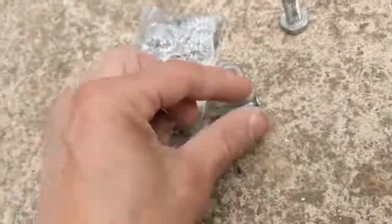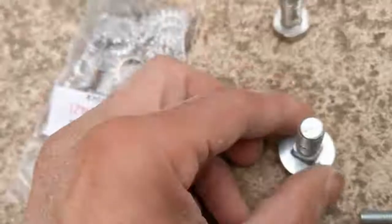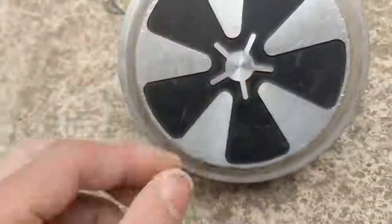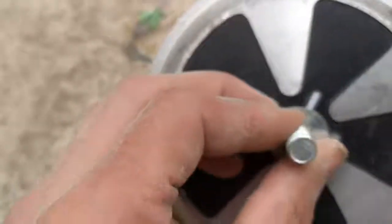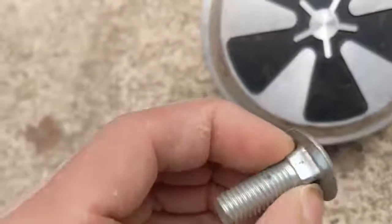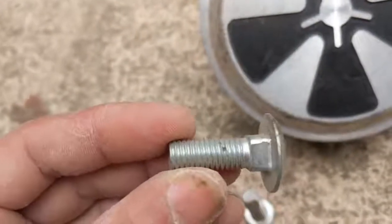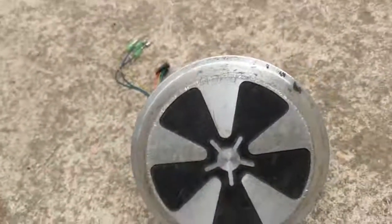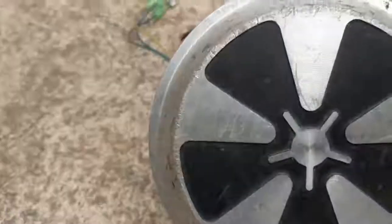When I looked for such a screw in 10 mm I found this one. You might have to make it a bit smaller — maybe 50 mm space inside, flattening by another two millimeters before the bearing begins. You would have to turn the screw into the square and be careful that it stays centered, since the square is a little bit bigger than 10 mm.